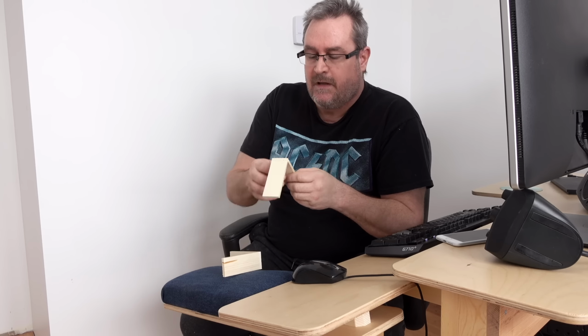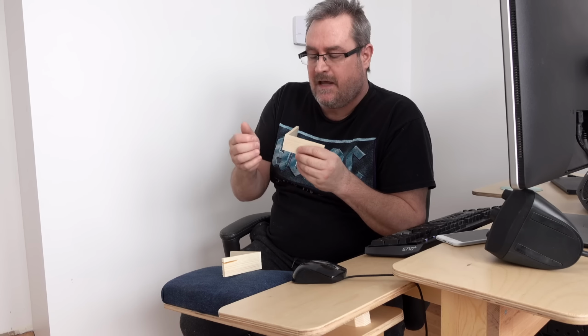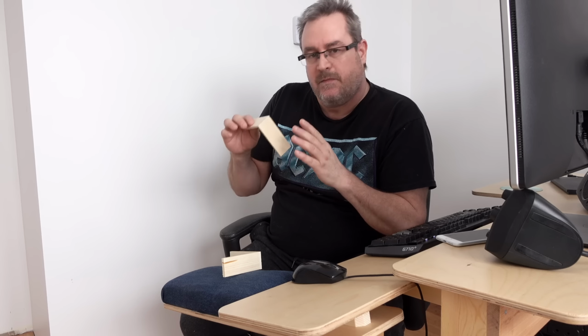If you're looking for something that just looks good, because box joints do look pretty good, so if you're looking for the decorative effect, then go with the box joint for that reason. More than likely you won't need the extra strength in most applications because the butt joint will work. I'll give you another example, and it has to do with me designing this desk. This desk is what I'm calling minimalist. The design is very minimal. The construction is very minimal. It doesn't have any complex joinery at all. I think I use biscuits in one location only, but you don't really need those either.